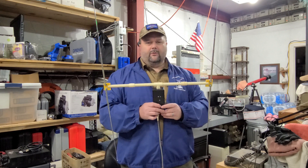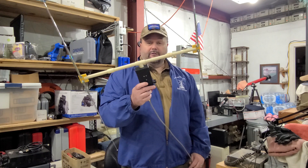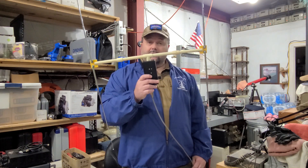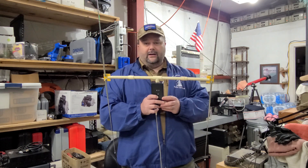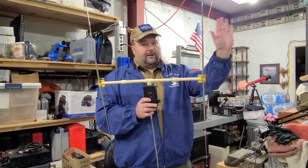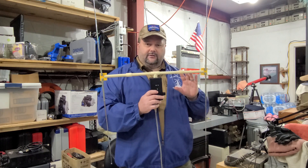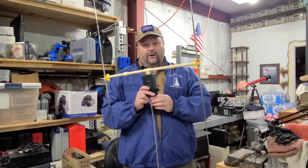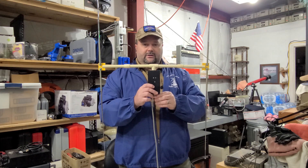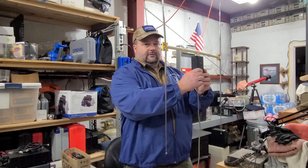We're back, folks, and we're going to do some more initial testing of the SDF-1 directional finding antenna. We've got a kit of one of these coming in and we're going to show the build process. We've got a nine-volt battery inside. KY4BDP — Brian — has a handy talkie talking on low power, and he's walking out away from us. We want to show that when you are broadside to the signal, you get a nice clean signal, and when you point at it, you hear the tone dip.